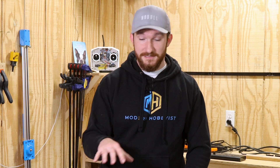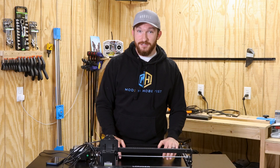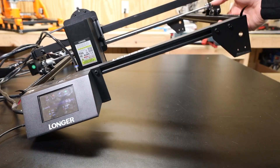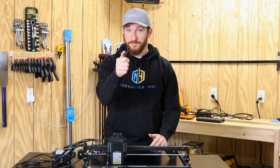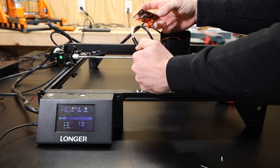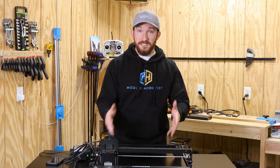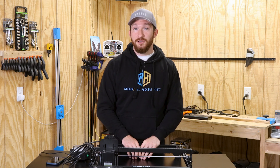Next up, I want to talk about safety features. Laser engraving is not as safe as these open-air companies would have you think. This machine has a tilt sensor, a flame sensor, a data connection loss shutoff, and it'll stop engraving if it stays motionless for 10 seconds — but they were spotty at best. The tilt, motion, and data cutoff sensors seemed to work most of the time, but I could not get the flame sensor to work no matter what — I even put the flame directly on the PCB, which probably wasn't smart. The biggest dangers from these machines are the fumes and the fact that they're lasers, so please use some sort of enclosure and pump those fumes outside.